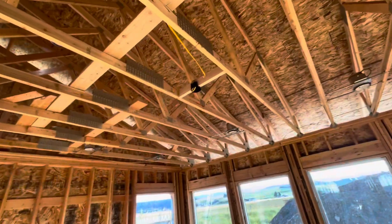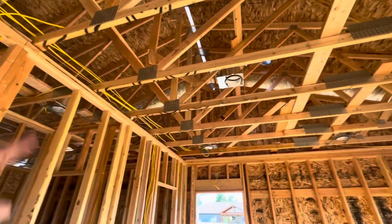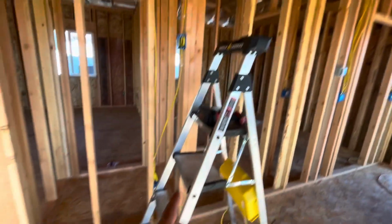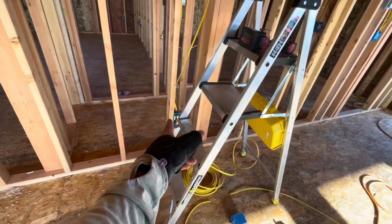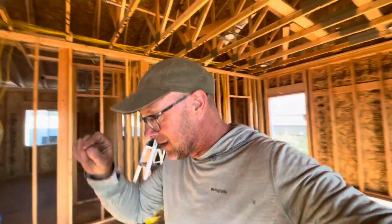All right, I put my last 2 ceiling fans in and discovered I had forgotten to run power in a line. So I'm going to run that ceiling fan off of the living room outlets. I don't normally like that, but that's close enough. I can label it on the back panel, living room outlets and ceiling fan. I don't like having a bedroom and living room ceiling fan together, but as long as things are in the same room, I think that might be my only thing that is a little bit different.